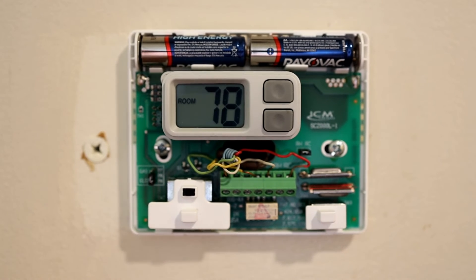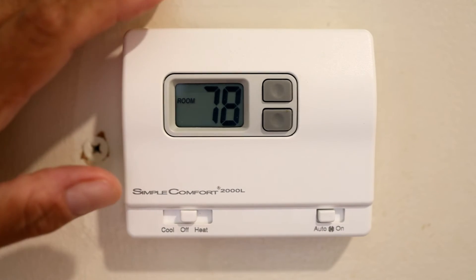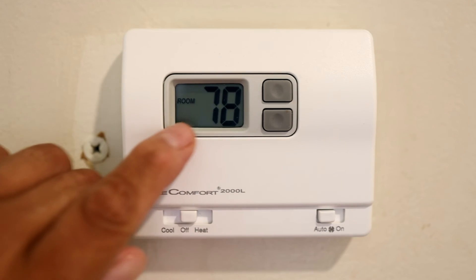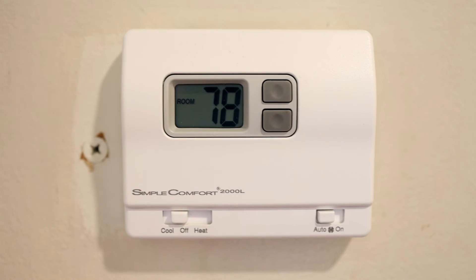This particular one is a really no-frills thermostat. Wireless thermostats are a whole other ballpark. Normally the display will say 'heat' or 'cool,' and if you put it on cool while it's in a delay, the word 'cool' should blink on the screen to indicate it's waiting. If it's not blinking, this particular model just doesn't have that feature — but it did click on, which is good.